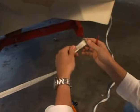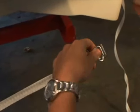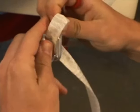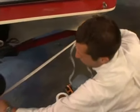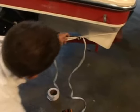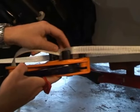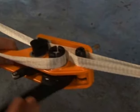The buckle is installed in the strapping so we can put a tensioning tool on it. We want this band to be extremely tight — this is the band that is holding the entire cover on. If it is loose at all it can chafe and move up and down on the side of the boat, causing scratches in the gel coat or paint during winter storage. Also if the band is loose, snow sitting on top of the cover can pull the band up allowing snow to fall inside. Ryan is putting the tensioning tool on right now — it easily slips onto the strapping, and you can put the strapping through any of the slots in the capstan. We want to make this really really tight.